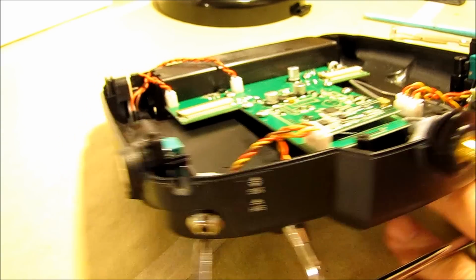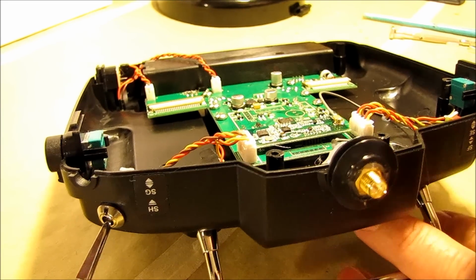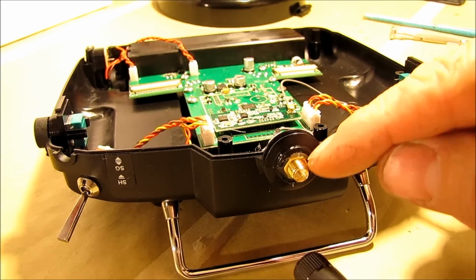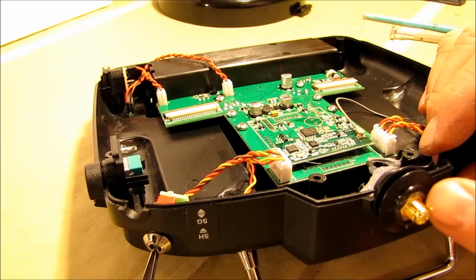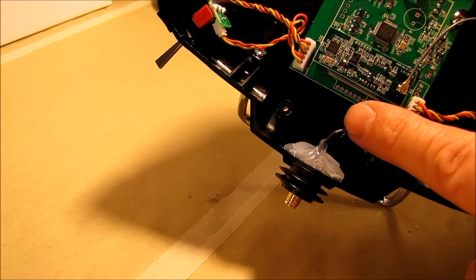antenna. So what I did is I screwed the antenna on this way, and then I ran this nut up to the bottom of the antenna right here. So I make sure when I screw this in that I had the antenna fully seated inside the connector there. And so what that did for me is when I stuck this in here, I left this flush, and I left the rest of it sticking out here.